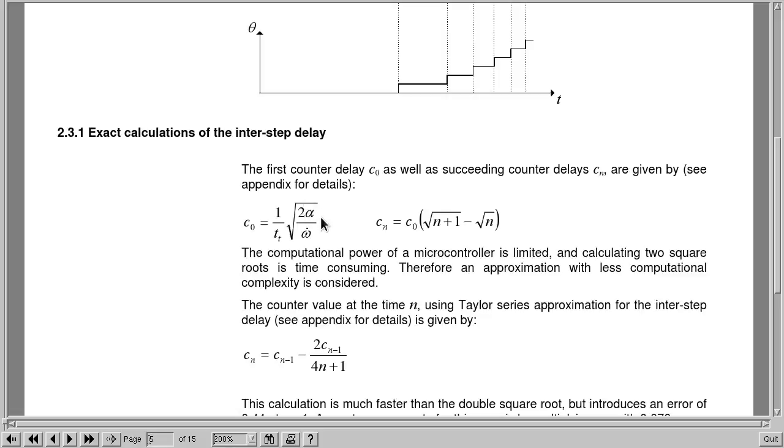And I have not worried about that, because what I'm going to do is just put a number in for this, look at what kind of speed it gives me, and then adjust it and make it fit whatever I want it to be, without knowing that it's going to be X degrees per second when I put these numbers in here. So that's another thing I should mention about my library. I called it a library, didn't I? My code. You will not be able to get an exact specific degrees per second speed from your steppers. You'll just have to adjust these numbers to suit. So for my purposes, I'm just going to use a constant for this.